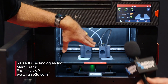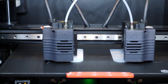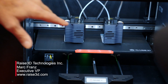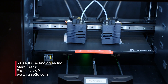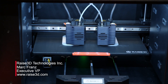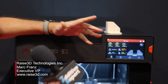So you can actually do mirror mode — you can print a left and a right in this printer, or you could have the nozzles together printing as a dual nozzle, dual filament printer. You can also print two separate parts at the same time. Right now we're doing a mirror mode of these brackets, but I could print the bracket on the left and the bracket on the right. So it's basically twice as fast, because you're printing two pieces. Think about the foot industry — I can do a left insole and a right insole at the same time.